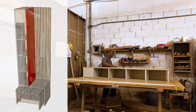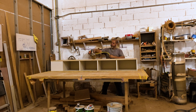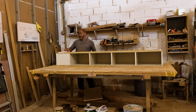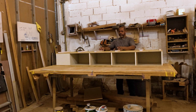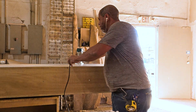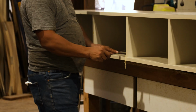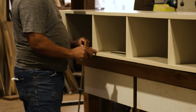Here you can see him applying contact cement to the side of the panel so we could hide all the screws and staples. Here's Gregorio trimming the piece and giving it a little sanding so it doesn't leave the edges proud and you don't chip it moving around. In this part, it had already been laminated and he's finessing the edge banding. This was done manually. I did a little recess in the shelf so it would have a little detail in there.